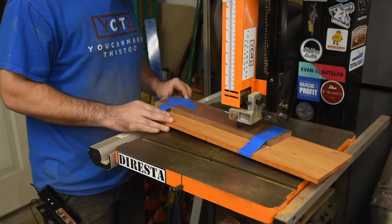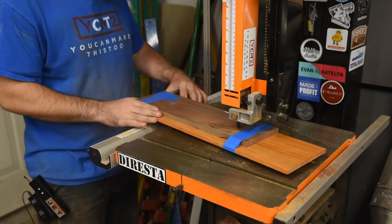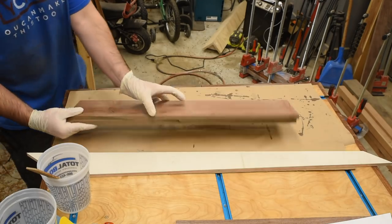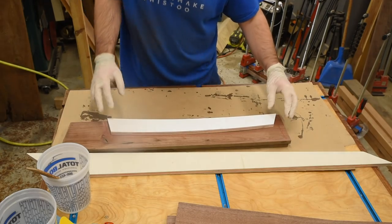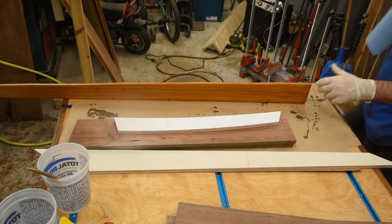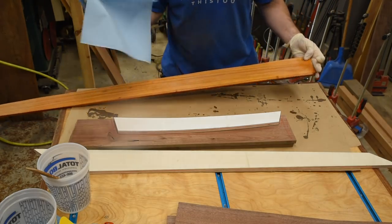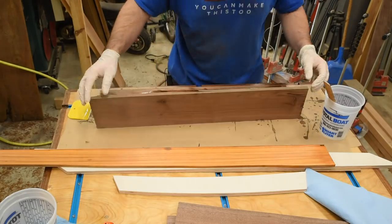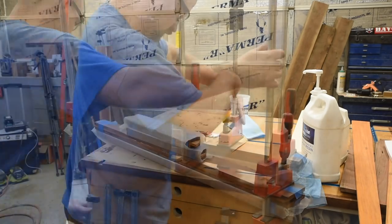I'm not doing much larger glue-ups than I need, and because I need some of the orange heart offcuts in order to make all of my pieces, I tape the legs together and rough cut them on the bandsaw. I'm using the orange heart offcut from the long pieces to make the blanks for some of the smaller pieces. Orange heart is a tropical oily wood, so to make sure I won't have any issues with the glue, I wipe it down with mineral spirits to remove any surface oil and then remove the residue once it dries. Then I mix up some 2-to-1 Total Boat epoxy and spread it all out. Because it's not water-based like regular PVA wood glue, the epoxy is an extra bit of insurance that I'm not going to have any issues gluing the oily orange heart.